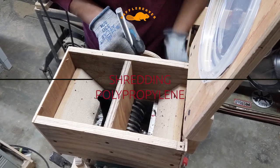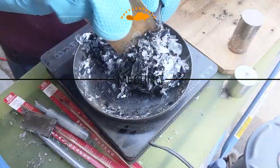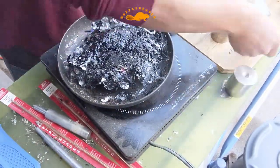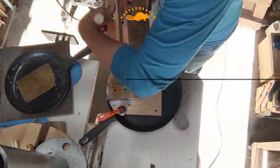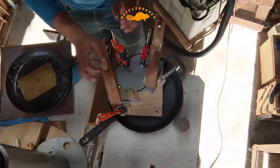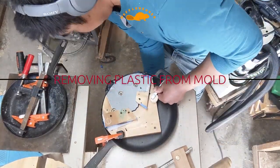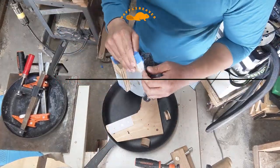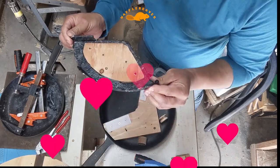Here I am shredding polypropylene — as you can see, it's plastic containers. I take that shred and melt it into a pot, then compress it and keep melting it until it's a homogenous black-looking thing. Then I throw it into the mold, which is another cast iron pot, and get as many clamps as I can to compress it. Getting the clamps onto the mold is actually stressful because the polypropylene cools pretty fast. It's always a relief to take apart the mold and see this piece that's molded perfectly into the pan — it's just cool. This is one of the best feelings about recycling plastic. You take it apart and you get this perfectly shaped piece. It's unreal.